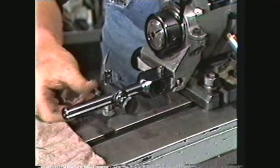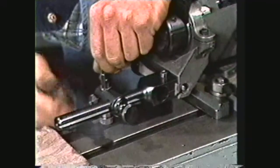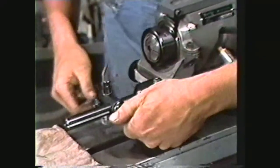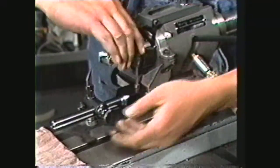Check for a guide hole. If there is none, drill a clearance hole. Now tighten the knurled knob on the outboard arm, and finally the dovetail slide. A carbide finger, shaped and tapered, will be used in this demonstration. Carbide fingers last longer than hardened steel.